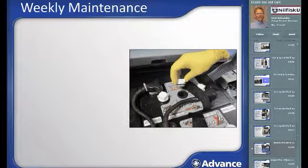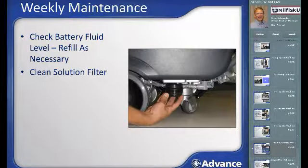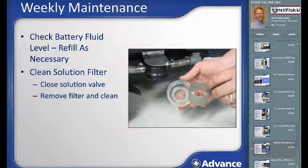Routine maintenance: besides daily maintenance steps, there are also periodic maintenance tasks. Weekly, for machines that do not have maintenance-free batteries, check the water level of each battery cell and add distilled water as needed. Fill to above the plates and to just below the bottom of the fill tube, not all the way to the top, to allow for expansion while charging. Failure to keep the battery fluid level above the lead plates will decrease run time and overall battery life significantly. Caution: batteries are filled with strong acid — use care and protective equipment when inspecting and maintaining battery fluid levels. Clean the solution filter, located on the left side lower back of the machine. Turn the isolation valve to the closed position, unscrew the filter cover carefully to not lose the O-ring inside, clean out the filter screen, and reassemble — being sure to open the water valve again, or no solution will come out during scrubbing.